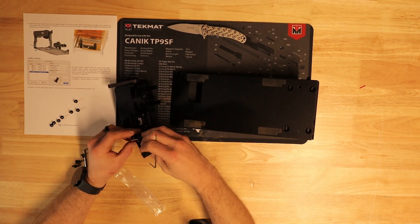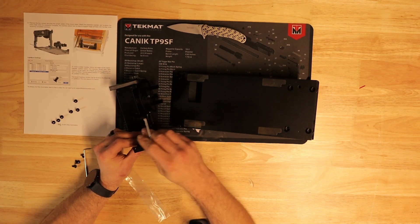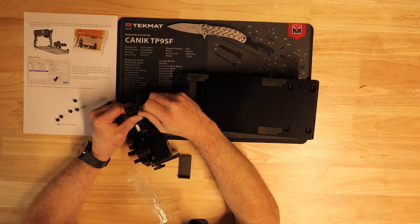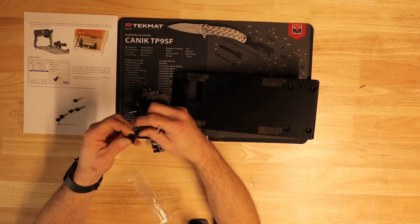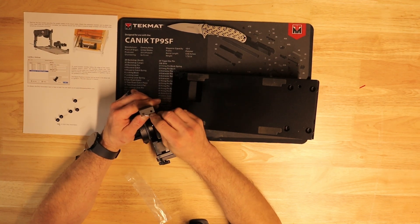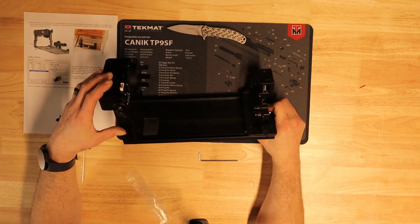The new screws appear to be shorter. The rotary comes right off and we just attach the four new screws — the threaded end goes towards the bottom, and the non-threaded end goes up against the chuck bracket. Use the non-ball end of the wrench to tighten it down just a little. Remember: this is steel going into aluminum, so don't over-tighten. Tighten the thumb screws to keep things from flopping around. Now the rotary sits with the extension so you can see the amount of height gained — you can do much larger tumblers and other items.